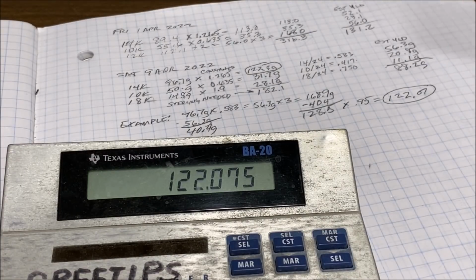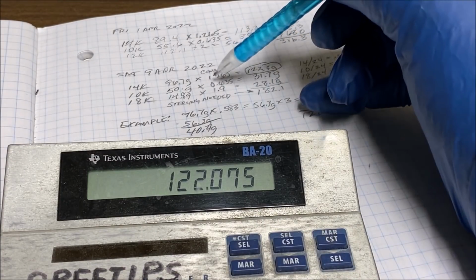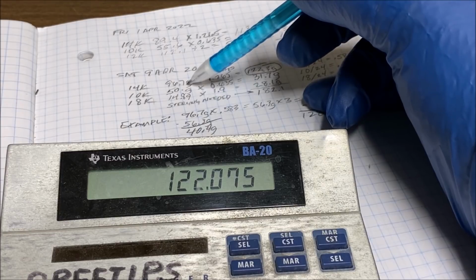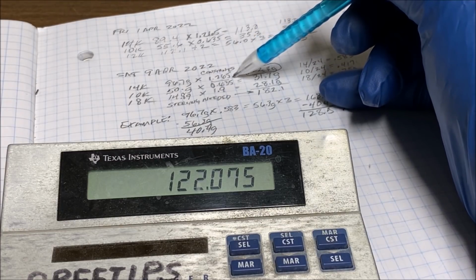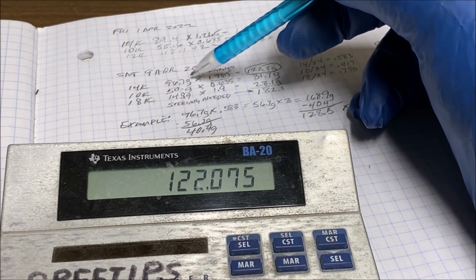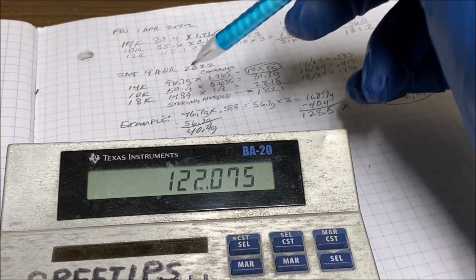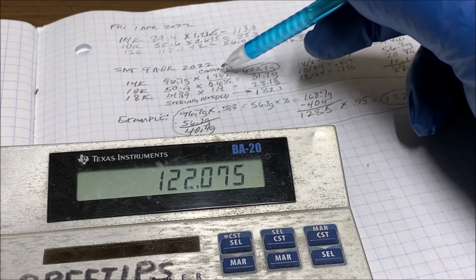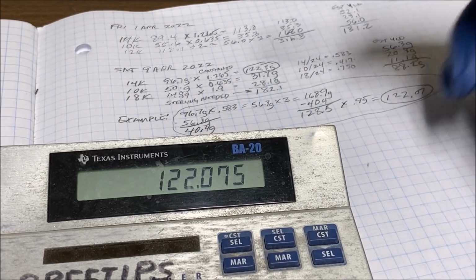So the bottom line is, if I use this constant right here every time on the amount of karat gold, 14K in this case, that I'm refining, it will perfectly give me the amount of sterling silver that I need to properly quart this amount of gold, rather than having to go through this entire process. I just make one calculation using this constant.